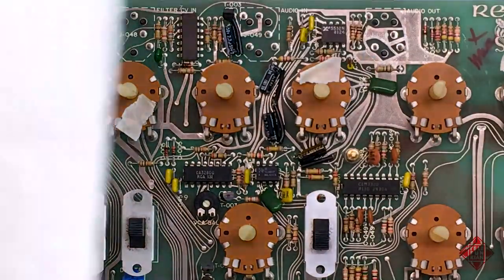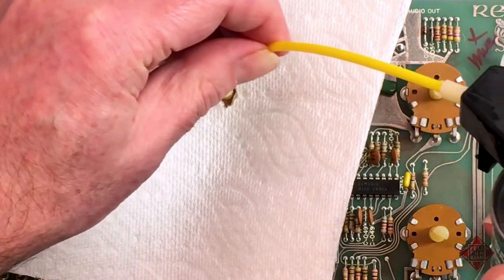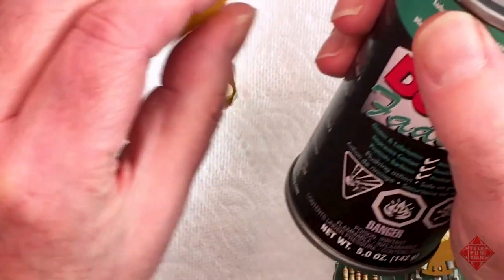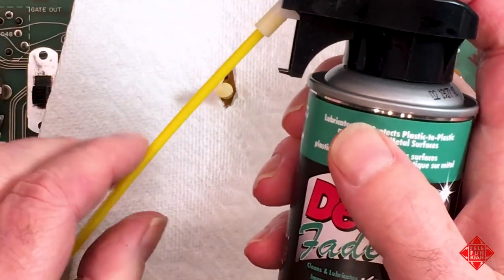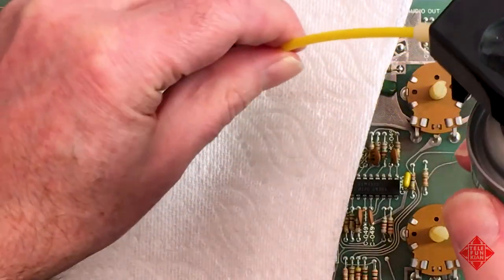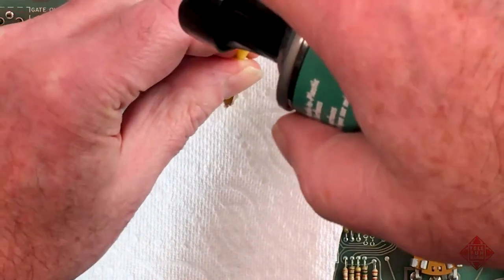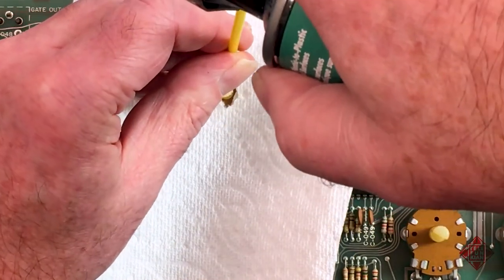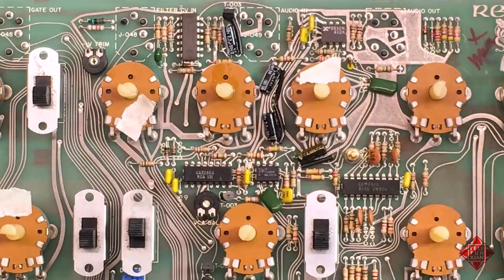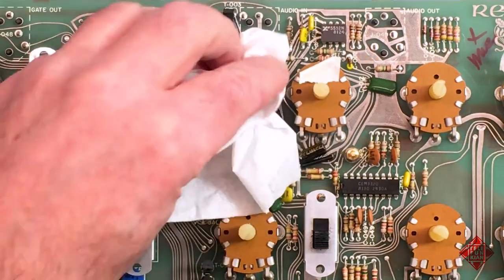Oops, wrong chemical. And although you can bend this nozzle, if you attempt to squirt it with the nozzle pointing down, you're actually not going to get the material through the nozzle. And so you want to make sure that as you're squirting it, it's actually straight. Or at least straight with respect to the bottle.